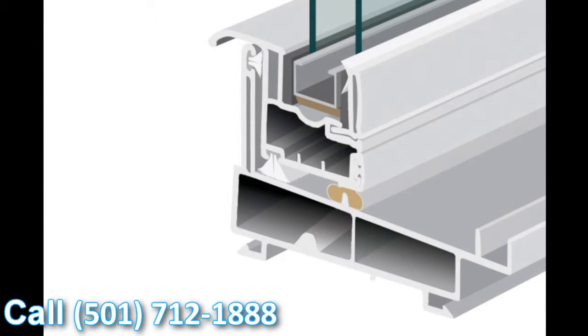As we take a closer look at the corner cut, there's a couple key features and characteristics I wanted to point out. The next feature that I wanted to talk about is the straddle gasket that you see. When the window is engaged and locked, you can see this Q-Lon weather stripping goes over the top of this upturned leg and creates what we call a straddle gasket. So when the window is locked and air or water is trying to get into the inside of your house because it's windy or what have you, it's got to go underneath the straddle gasket, over the upturned leg, underneath the upturned leg, underneath the straddle gasket, towards the inside of the window.